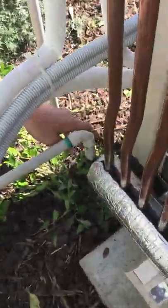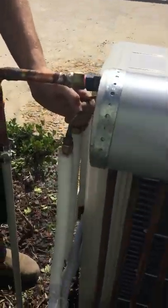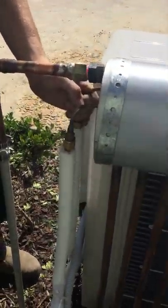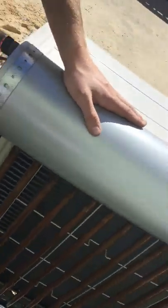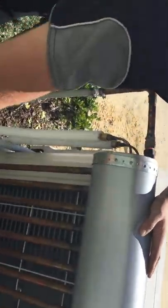What this does is the water runs generally through the copper pipe and then slowly rises up through these tubes here, so it pre-cools the air coming onto the condenser and also sub-cools the refrigerant going through here through your liquid line. As you can see, we're connected through our liquid line from our valve coming up through here into our tank, and the water is circulating through here like a big heat exchanger, then exits out through here and heads out to the evaporator to complete the circuit.